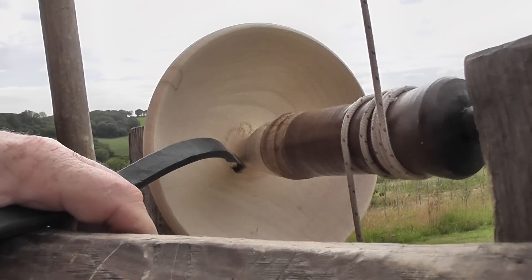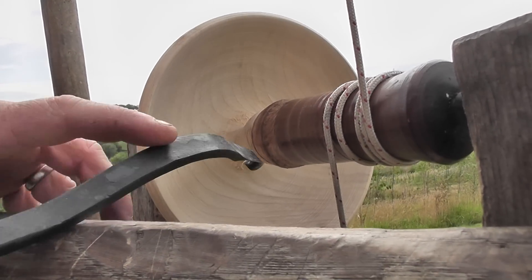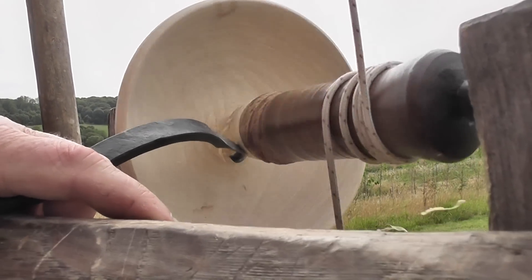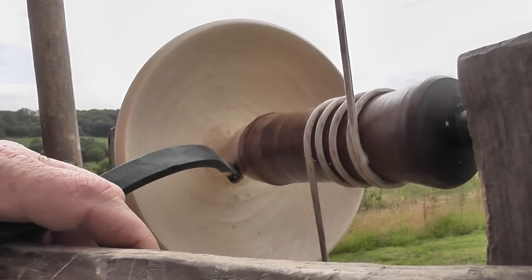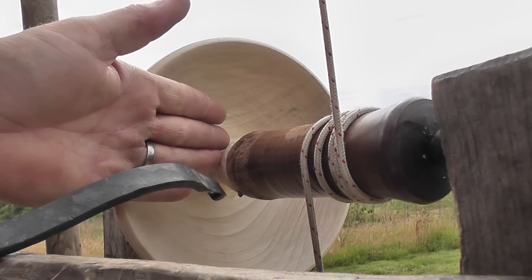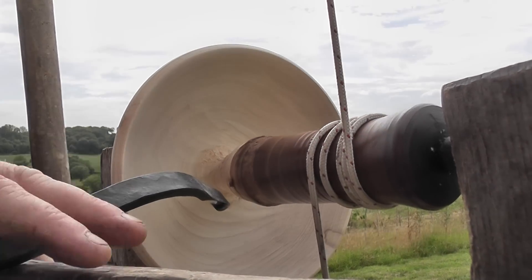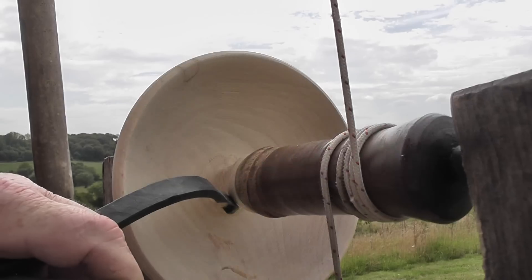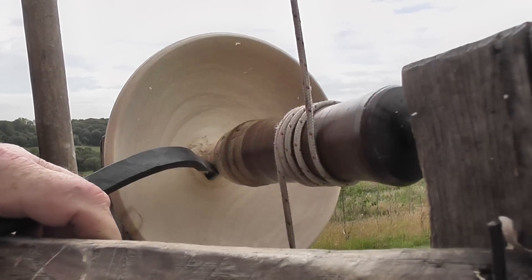You can see it's just rubbing slightly on the back edge of the hook. Having it double-bevelled is a slight disadvantage but it does mean you have two different tools. We can't cut straight in there because we've got our metal nails, so we need to make sure that we leave about half an inch to three quarters of an inch before we start to cut that taper in.